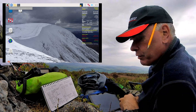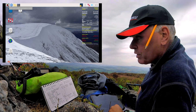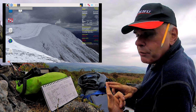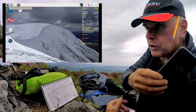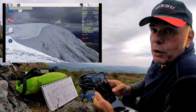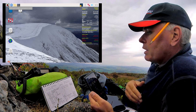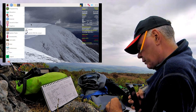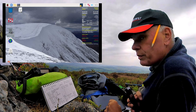The tablet thinks it's the 14th of February 2019. We need accurate time for digital modes. There are three ways of doing this with this Raspberry Pi: we can fit a real-time clock chip, we can fit a USB dongle and get time from a GPS USB dongle, or the third way — which is the way I'm going to do it — is to use a handy little app called GPS Forwarder and stream GPS data with accurate time from my phone to the Raspberry Pi.